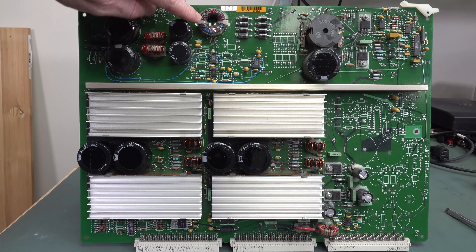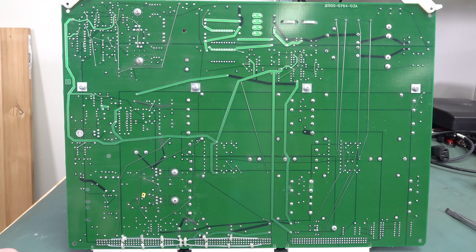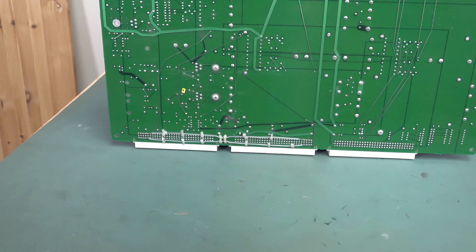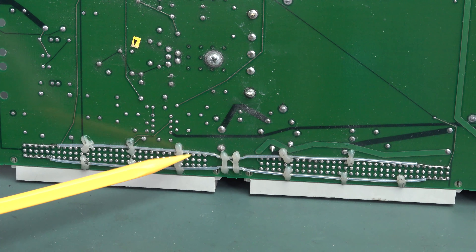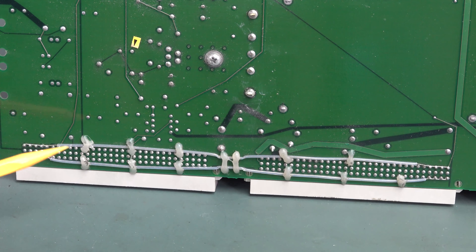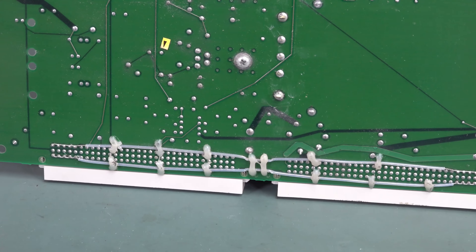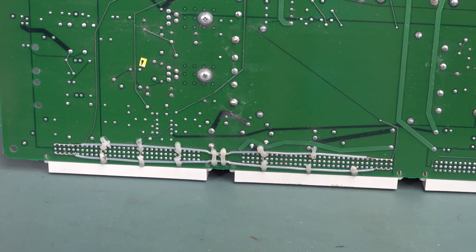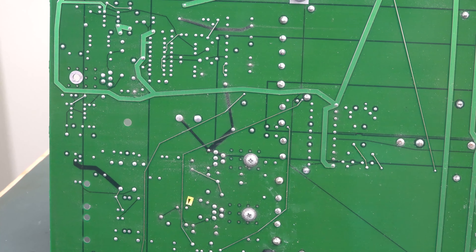There are some custom jobbies cable-tied down and wired in — they look a bit rough, but it gets the job done. The back side of this board is a six-layer jobby. They're certainly not a fan of straight traces — running higgledy-piggledy, which I can't stand. And there's some serious modding on the bottom with insulated wires joining pins across to other resistors. That could be a remote sense bodge — maybe they goofed up the layout. It'd bug me if the traces were like that. Give me my 45s please.